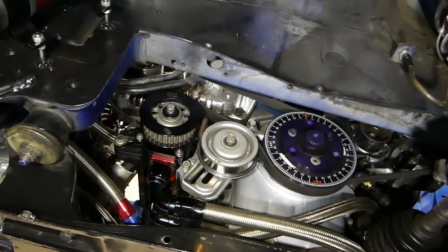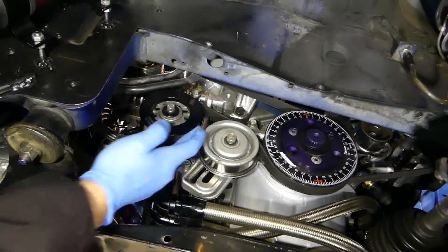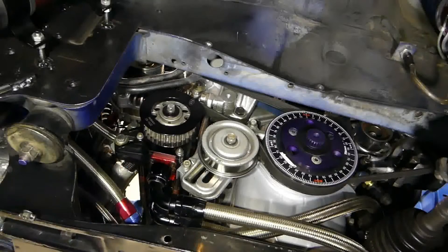Back down here again — the tank has been topped off, should be all good now. You can go really fast, I just don't like to — that little piece I made likes to wobble, but it does the trick. I'm probably building 12–14 PSI oil pressure by doing this, which is actually pretty cool. I just want to make sure that oil filter is filled with oil and this whole system is primed with no air in the lines.